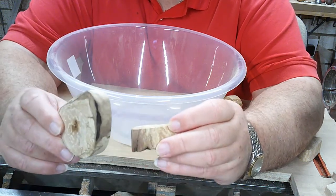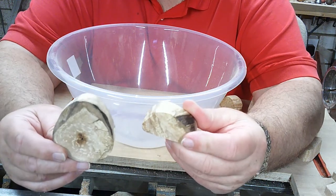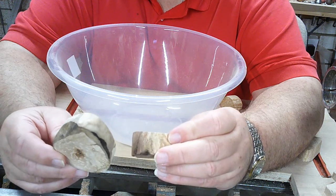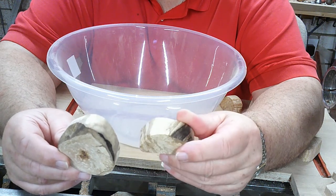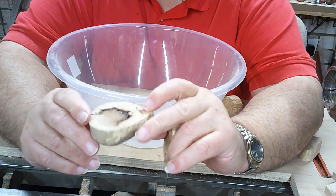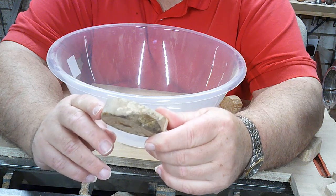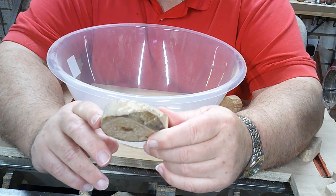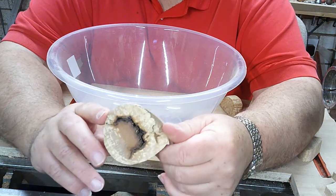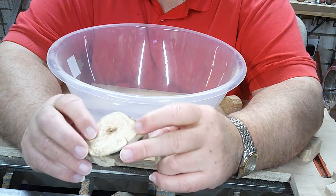In most woods you get fantastic pattern. It's what they call spalted, and it does give you beautiful colour variations through the wood. It is beautiful, but as I say, once it dries out it all dies off, and all you're left with is those beautiful markings. And if you seal it with wax or oil or something like that, that stops any moisture getting in there. So it will stay like that for, well, I won't say forever, but quite a long time.